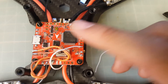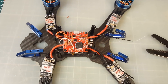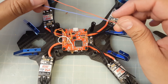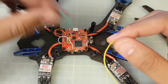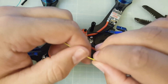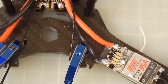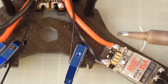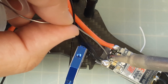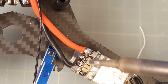We're basically almost done — all we need is the camera connections and the ESC signals. We'll do one together and then skip the rest. I've found a couple more silicone wires — I really like these. Let's start with motor one. We'll strip this guy, do one ESC together, and just skip the rest to save time since it's the same thing all around. Motor one — let's retin the pads a bit. Here's signal, here's ground.